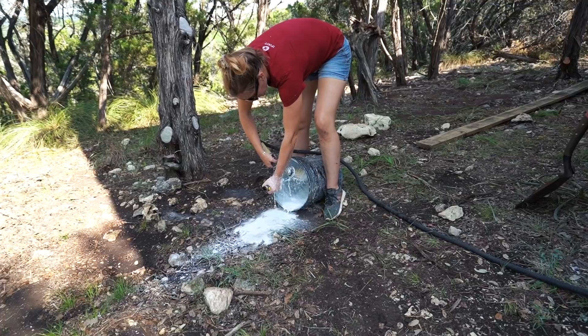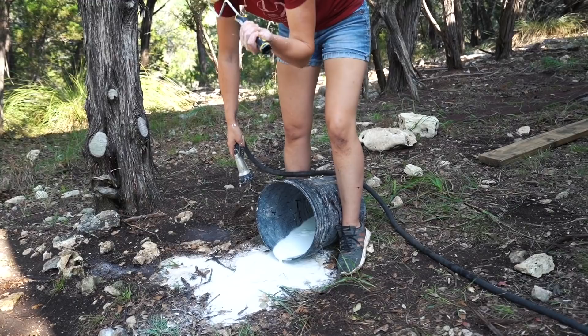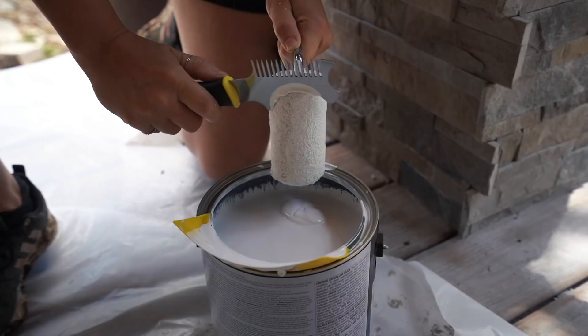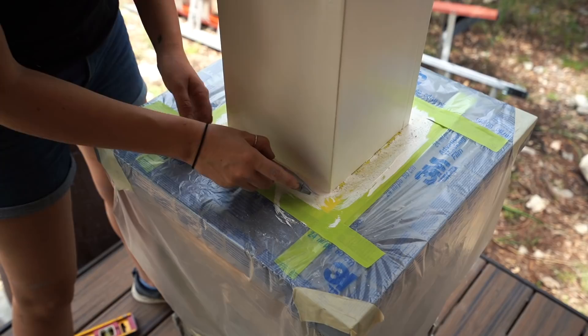Now let's finish off with some finishing tips. The best tip ever, at least in my opinion, is how to spin clean a roller. Also, if you spin it down instead of up, more splatter will stay inside the bucket instead of on your face. That is a crazy cool trick — you can feel how dry it is. Before you spin clean it, though, it's worth picking up one of these roller scraper tools to get as much paint out of the roller as possible before you take water to it.